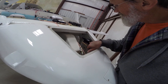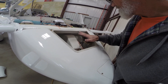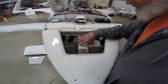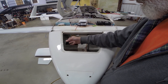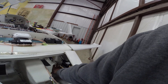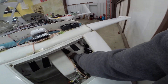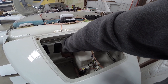Here's the AHRS with the pitot-static tube coming in. I've got the setup so I can balance or level the unit. There's a cover over the nose gear actuator. I have Dennis Olman pedals with taper pins to help take up some of the slop. As you may know, the rudders are independent of each other, so you can push both at the same time. The brakes actuate when you push a rudder to a certain point.